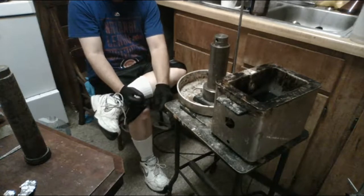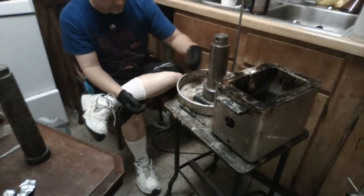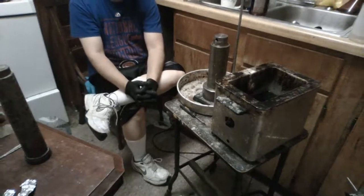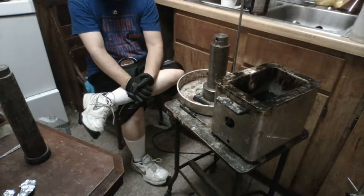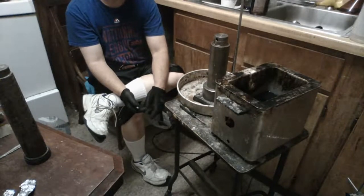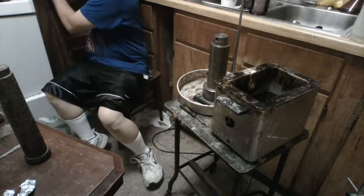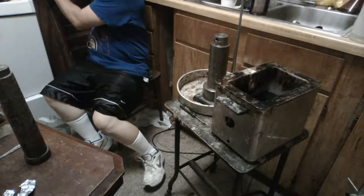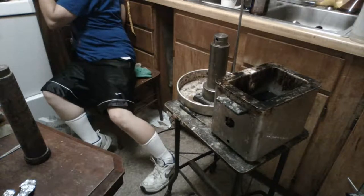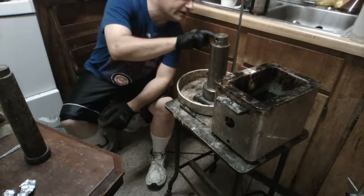As I said, this is a new wax, so I just have to kind of monitor how long it is by looking at the properties of the wax. And I do know that when this wax does congeal more, it has quite a bit of shrinkage. So I do know that much. As we started the timer at 35 minutes, and 5, 10, 15, 17 minutes have gone by, I think we should give it another 10 minutes, but it's a matter of checking.